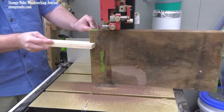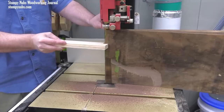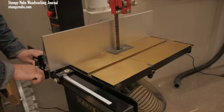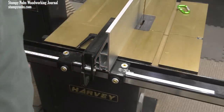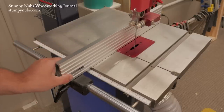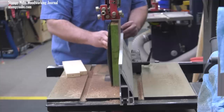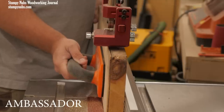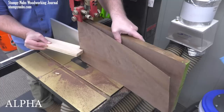The table is also bigger — about five inches deeper from front to back, which better supports boards when re-sawing and gives more room to work. One of my favorite features is the fence: it's built like a table saw's fence on a square rail. This means it glides and locks easily, and it lifts right off the table like a table saw's fence when you need it out of the way — a much easier process than typical fences that run on round bars. The aluminum extrusion on the fence also has higher support for wide boards on edge. Really, it's just a re-sawing machine. You can re-saw boards all day long on the Ambassador model too — it has the power and capacity — but I'm pretty sure I could mill a tree on the Alpha if I could just lift it up there.